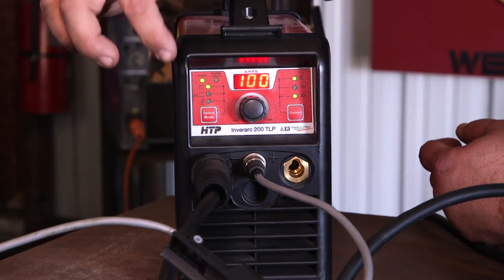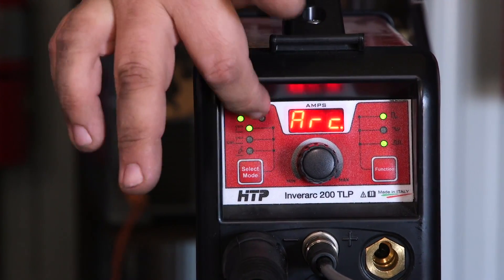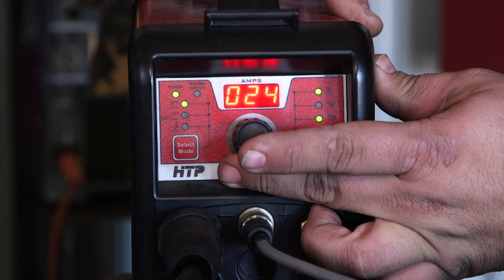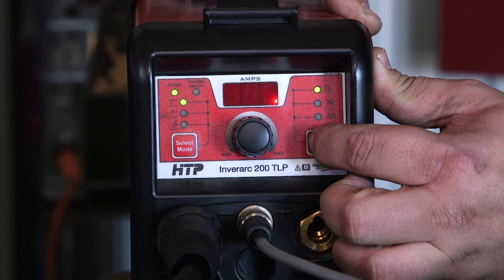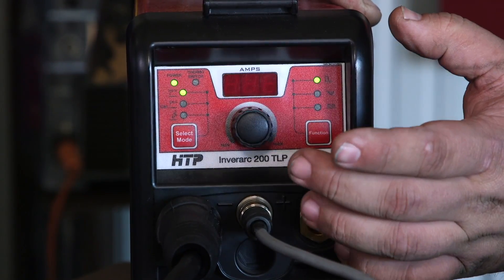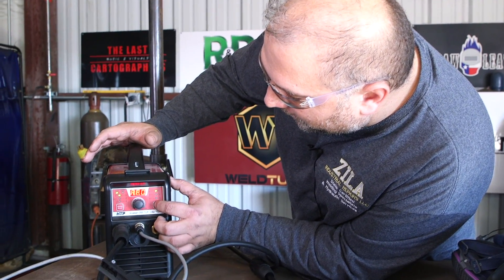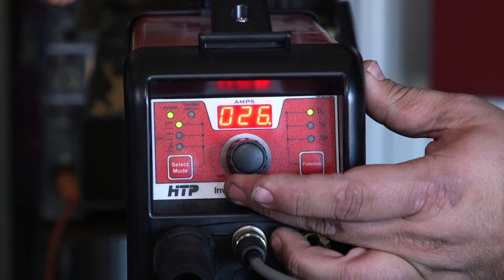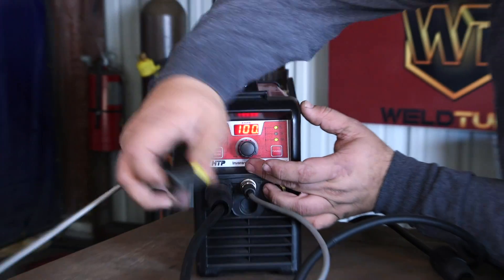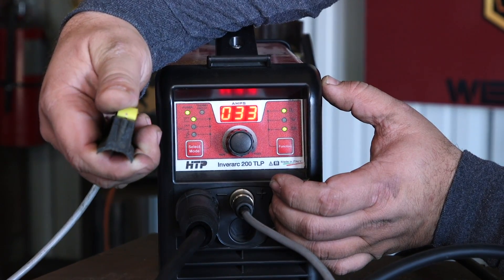Right here we are in the arc welding mode, which is your general stick welding program. Cellulosic is for 6010, but we're in the arc welding mode. Here we're picking arc force — you don't really need much, I'm going to set this to 25%. Then I'll turn the hot start on to 40% just to get the rod lit because we're welding on the lower end of what the rod is rated for. The pulse frequency I'm setting to 2.2 hertz, and my maximum slider I'm setting to 110 amps, so I can adjust all the way down while I'm welding.